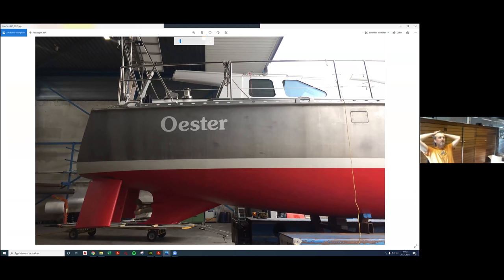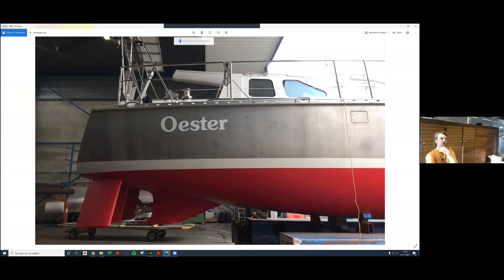1.1 or something. See, we had a boat before, identical to this from the start, was our boat. It was a 47 foot, the Samoa. A super good boat, but we had only 80 centimeters draft, or I think 90, and the rudders were also 90 centimeters. And if we were going downwind a little bit, running to hull speed, the boat was almost unsteerable. The autopilot couldn't keep up with it. So you feel when you push the boat, and I like to push the boat once in a while when you're sailing the wrong route because it's stable enough. Then you had hard times to keep her on track with the short rudders.